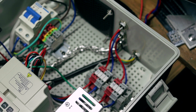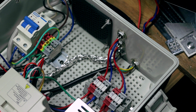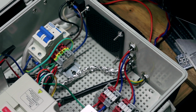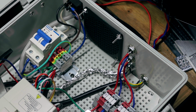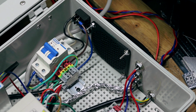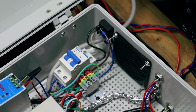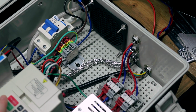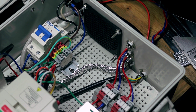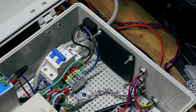So from there, having the aviation connectors just allows me to connect and disconnect this power supply as needed. So I can either move the DMC2 or move the power supply. I can mount it in different locations for cleanup, for doing anything. It's just way easier to have that in a completely detachable box that is enclosed and dustproof. And with the filter on there, it seems to be doing a really good job of keeping this clean inside, but still giving me good airflow and a way that I can house all of this without it just being splayed out all over the place or attached to a board hanging out in open air.